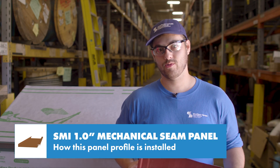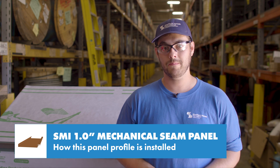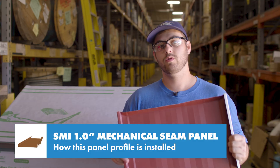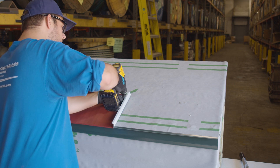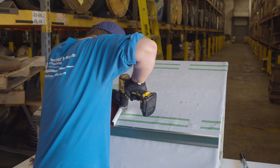Now let's look at how this goes down on a roof. Make sure to follow any installation guidelines or requirements available. I've already fabricated these panels with a 1-inch bend at the eave and a 1-inch box at the top, but if you want to learn how to do it yourself, there are a couple links in the description below. On the deck, the panel hooks onto the eave, is pinned on the box end with a couple fasteners, and uses clips on the male leg.